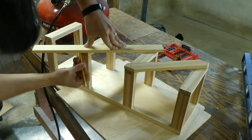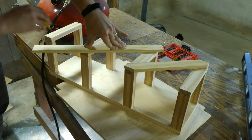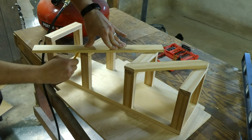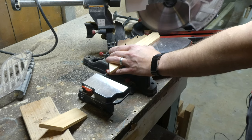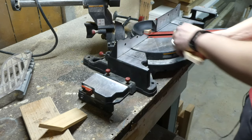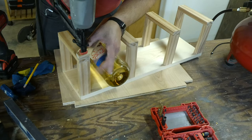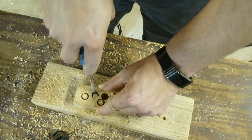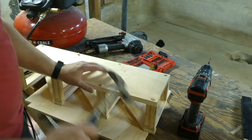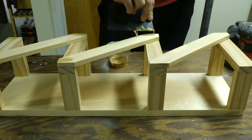We're in the home stretch. To get the angles right for my crossbars, I simply grabbed my 1.5 inch finished board scraps and eyeballed the angle. Marked with a pencil, and then I took them over to the chop saw. I then glued and nailed each piece in place. I also wanted to cover up the screw holes on the back, so I made some plugs and hammered them in. The sander will take care of the bumps. Finally, I put some putty on the nail holes.